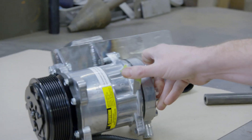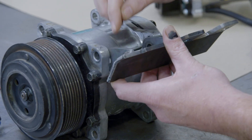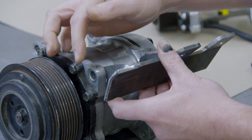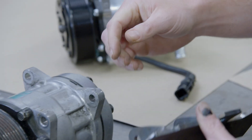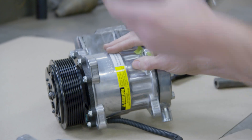What we have to do is add a little bit of tubing here for some spacing. We had a tab hanging off of this that sits a little tighter than it will on this, so we chopped that off. We're gonna add some material to this, space it out about a quarter inch so it wraps around here and we're nice and secure, and we'll show you the fitment over on the other side.